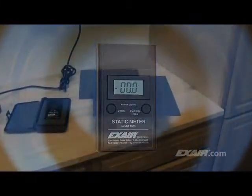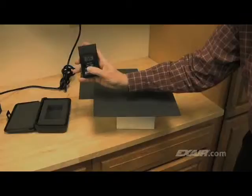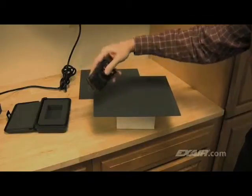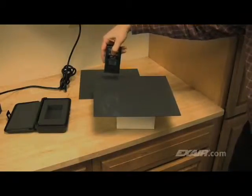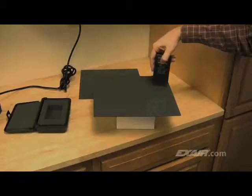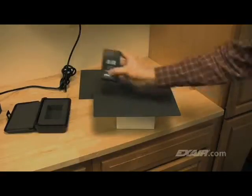We'll turn the meter on, then zero it. It's important to zero the meter to obtain an accurate voltage reading. A common practice is to aim the meter at the ceiling where there's no charge, then push the zero button. When the button is released, it will read zero or close to it depending on the dryness of the air and the charges on the surfaces close by. People can't feel a static charge until it reaches about 1,500 volts. When the meter is aimed at the plastic, the charge on the surface is very low, approximately 200 to 300 volts.